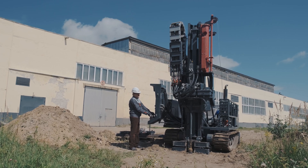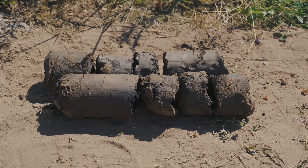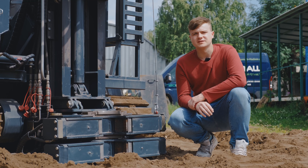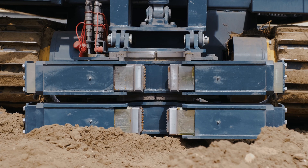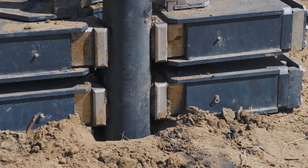Core pipes, the drive tube and the sampler are used for coring. This technology is used in grounds of first to fourth categories. At the bottom of the mast, the hydraulic drill table is located. To ease round-trip operations, the maximum diameter of pipes is 200 millimeters.